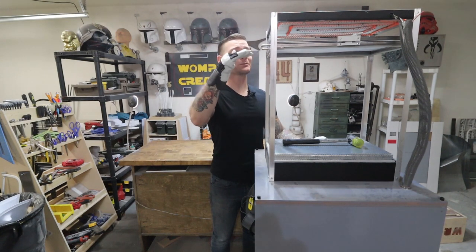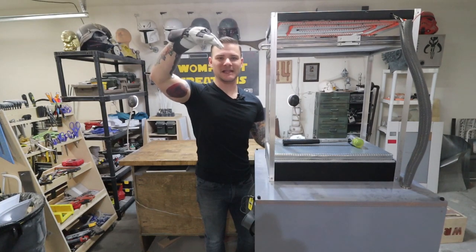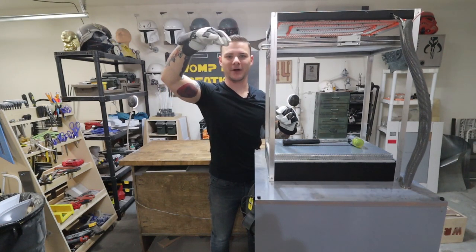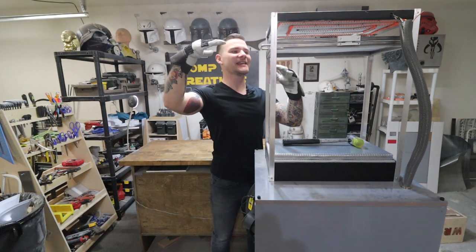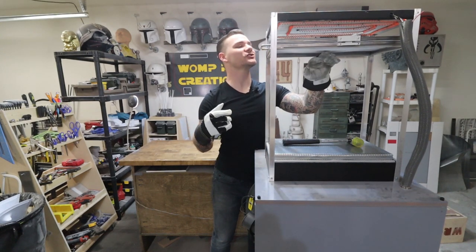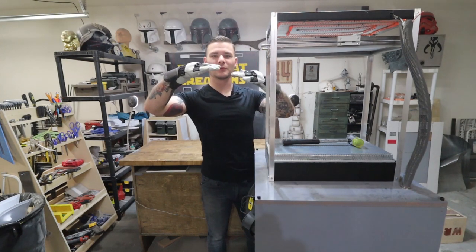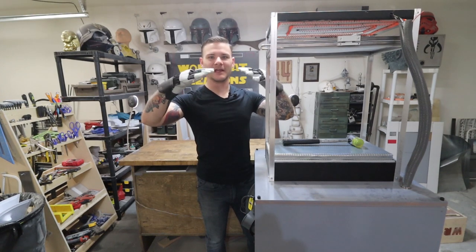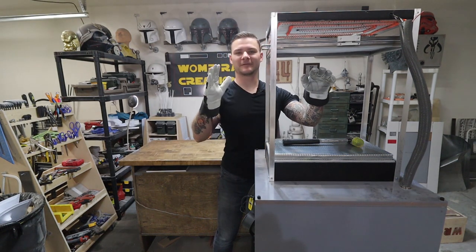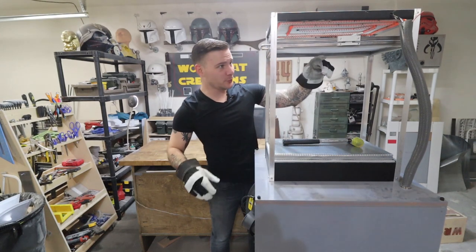But what I was going to say is when you suspend a sheet of plastic below a heat source, it's interesting because at first the plastic will start to bow up towards the heat source, and that's because the top of the sheet of plastic is hotter than the bottom. So it'll start to buckle up as those molecules expand. Then as the heat goes through the whole thing, it'll start to droop. I don't want to move you guys to a different position so that you can see when I actually drop this down. That's when the whole sheet is heated uniformly and all the molecules are equally stretching and moving. But interesting thing for you to know: at first, it'll start to buckle up towards the heat and then it'll all uniformly droop. And it's drooping pretty good right now.